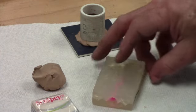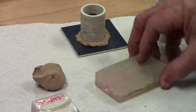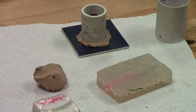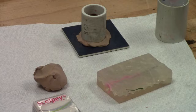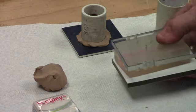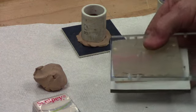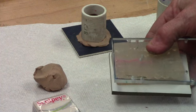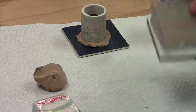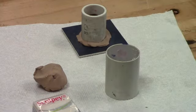For years in the jewelry industry, most of the molds were parallel sided molds, and they were cut in half. And you would hold a couple of plates on each side of the mold and inject this into the wax injector. Well, it's kind of awkward to try to keep even pressure on here and keep your wax pressure from opening up and causing flashing. So I've never used this. I never have liked that method. I prefer the tapered mold.